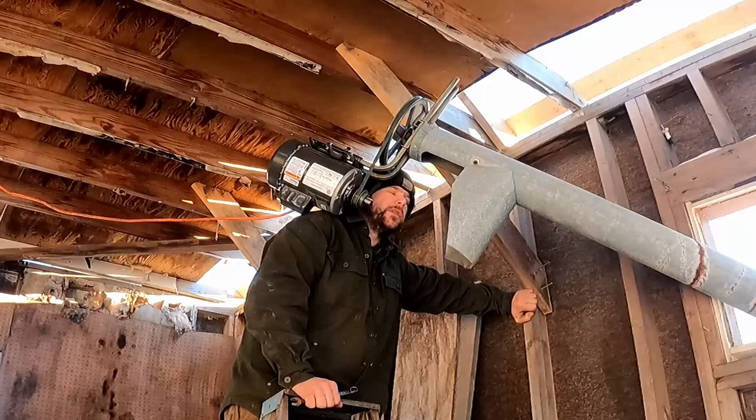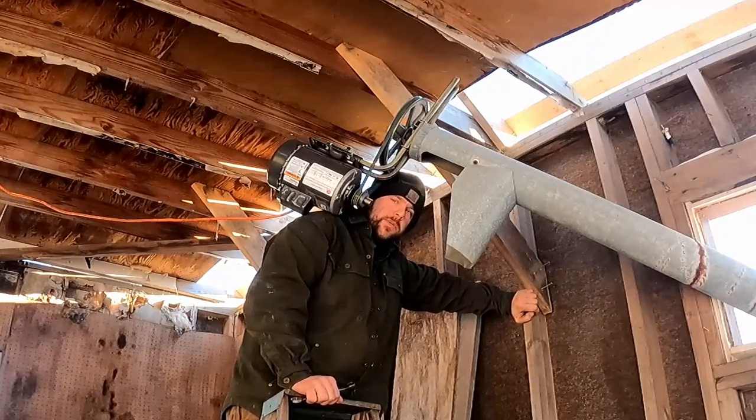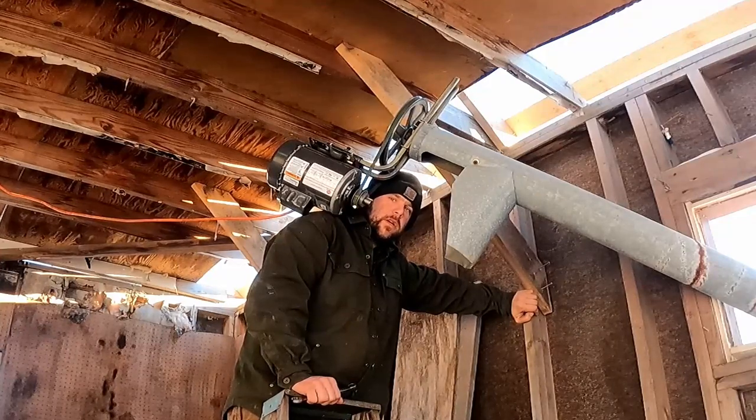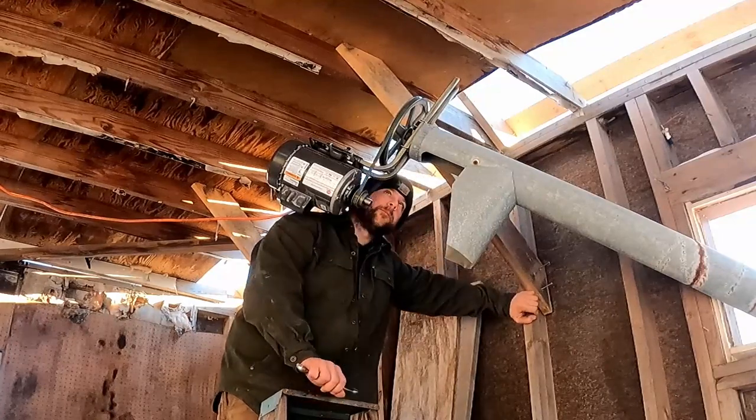It'll slow the auger speed down, which isn't really the end of the world. It may or may not help the situation with our lack of proper power. But either way, it can't hurt. And if at a later date I need to change back to this one, this pulley will be sitting on the shelf. But it's the middle of winter. I can't exactly dig a trench for proper power. So this is what we're going to do, and cross our fingers and hope it improves. It works the way it is. It just needs some improvement.